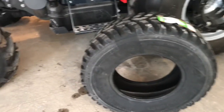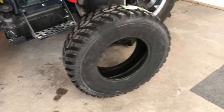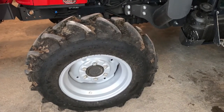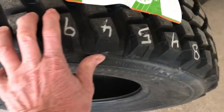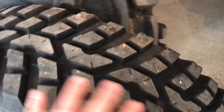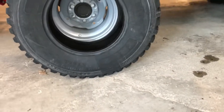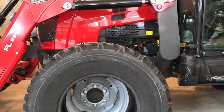Anyway, we're going to give it a try. One thing I had to do was make sure that the circumference of that tire was going to match the existing one. I learned there's not only a circumference when it's off the tractor, but there's what they call rolling circumference — what the tire really accomplishes once it's sitting on the ground. I think this tire is going to work okay. If it was a bad mismatch you could end up with driveline troubles between the front and the rear when you engage the mechanical front wheel drive. But you can see that tire is just about a perfect match right now.